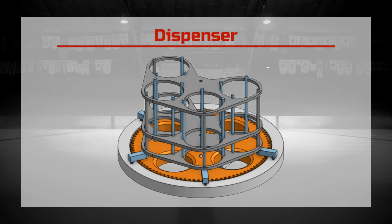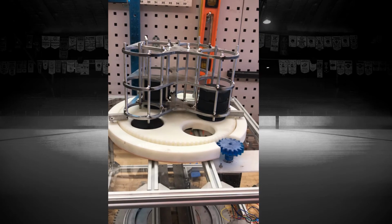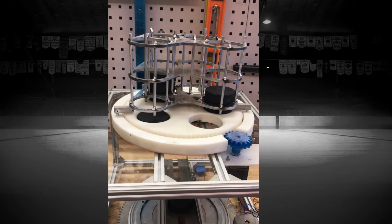Each silo can hold up to 6 pucks, which fall into the orange rotating disc powered by a gear and stepper motor. The disc rotates and drops the puck into the launcher. Here is a short video of the dispensing system dropping the puck. This video is from testing the step size, and therefore it pauses approximately every quarter turn.